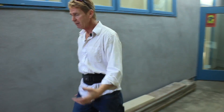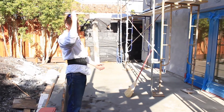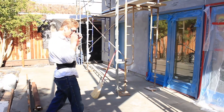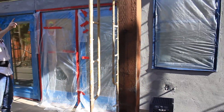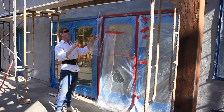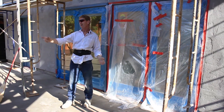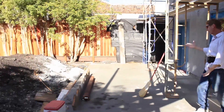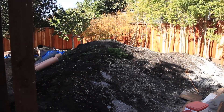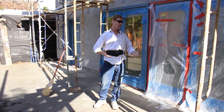The deck here — I told the contractor when he asked if I could get started so he could get the scaffold out. I said I could, but I'd prefer you to finish that deck first. That's a pretty massive deck going up, and when you attach that deck, that's movement and vibration. When they get rid of all this dirt, it's movement and replacement of soil. Thirty days of rain, let alone six months, is going to lift and expand this. That's stuff to look out for.